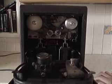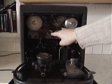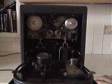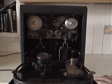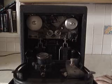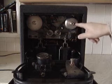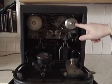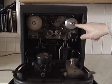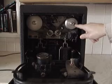This machine is a two-speed machine. This belt here can be pulled forward on this cog and dropped so that it runs at 30 inches a second, or in the upper roller which runs at 60 inches a second. As you can see from the size of the two rollers, this one's only smaller by a slight fraction. So when it's rewinding, it's probably only rewinding about one and a quarter times quicker than it is replaying when running at 60 inches a second.